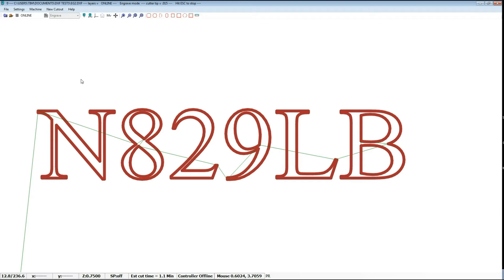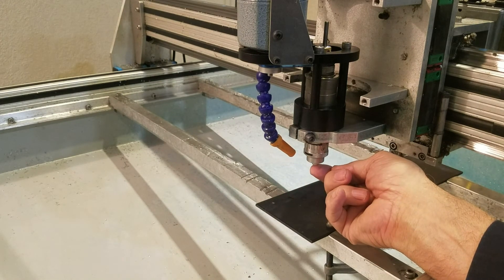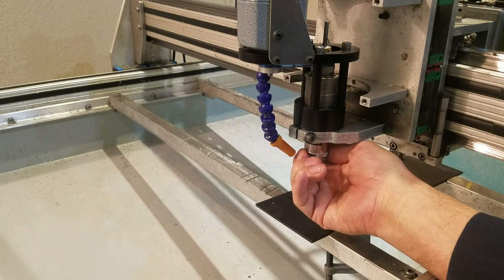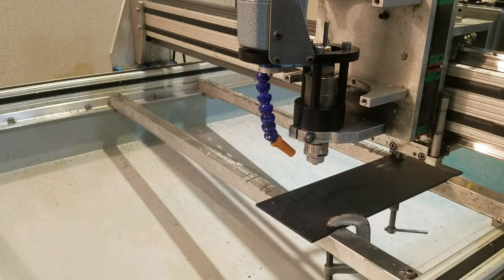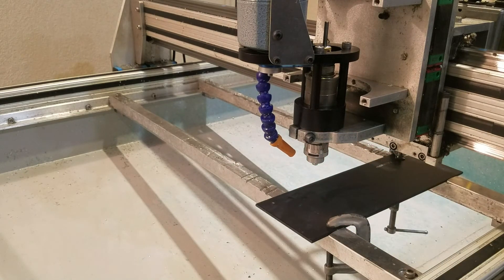Now that Avcam is set up, we're just about ready to cut. The depth of cut is actually set with this micrometer — it adjusts how far the cutter sticks out of the plastic nose. If we set this to 5 thousandths, for instance, it may be too deep or too shallow. If you don't know, start shallow. If you have an engraving plastic, the manufacturer will tell you how deep that top coat is. If you've painted, a paint thickness gauge is a good thing to have. If not, you'll have to experiment in an area that won't show — preferably a blank piece. I set this at 3 thousandths and let's see what happens.